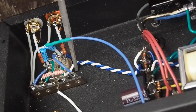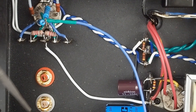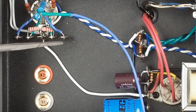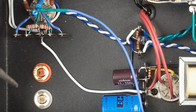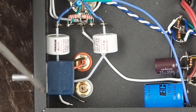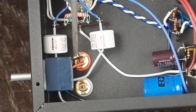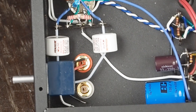That rounds out wiring up the front end of the preamp tube. Next, we've got these two output jacks over here, and we need to hook up the coupling caps to these two terminals. They need to go over to the volume control. One side of the volume control has the coupling cap, one side has the ground, and the signal comes off the middle. I wanted to install all of this with leads as short as possible, so I decided to put the volume control in with the terminals facing the chassis. That way the leads are as short as possible, and there's no reason to run shielded wire when you've only got about half an inch exposed.